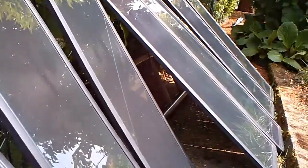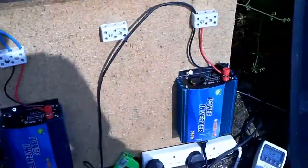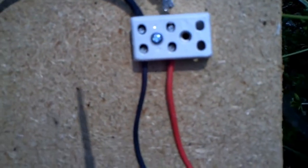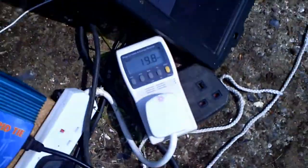We're now in the peak part of the day and the amorphous panels don't seem to be producing much more when they're in direct sunlight. I'm going to unplug this inverter so it drops to zero. I have another inverter set up here with a cable that I can plug straight in, and the panel is producing 19 and a half watts — it is shaded a little bit.